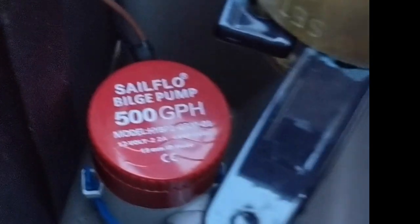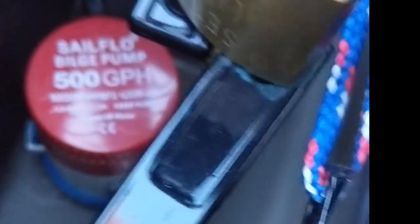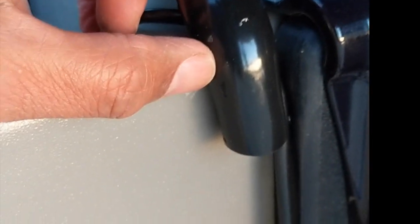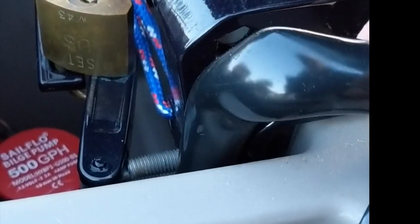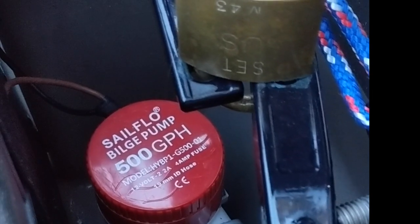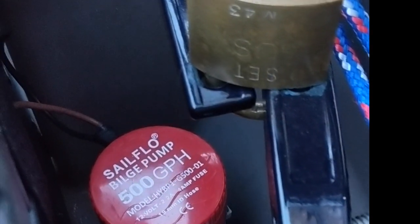So yeah, you put sand in your tubing. As you go to bend it, make a form out of some scrap wood or anything you need, and you warm it up — keep warming it. The sand inside your tube will keep the tube from flattening as you go to bend it. You might take a couple of tries, but the material is pretty cheap. It only took me one try. Like I say, I can lift it up anytime I want to be able to clean underneath — wipe with a rag like I did today, on this 50-something degree New Hampshire day.